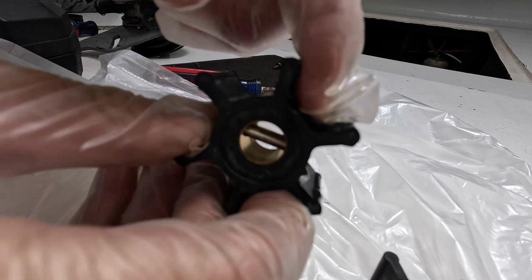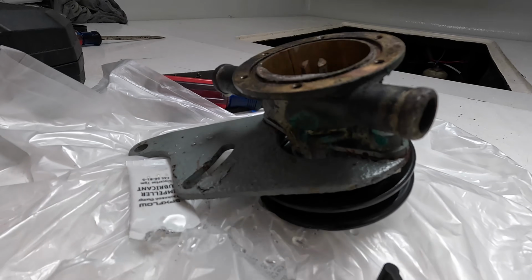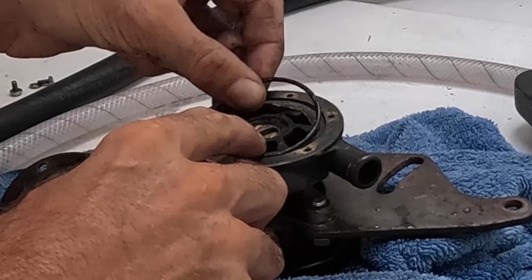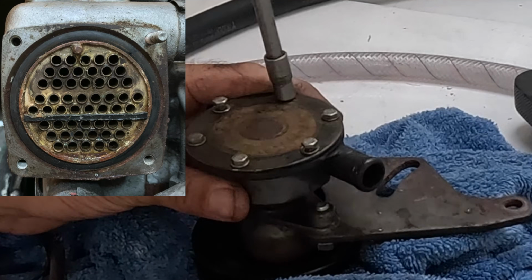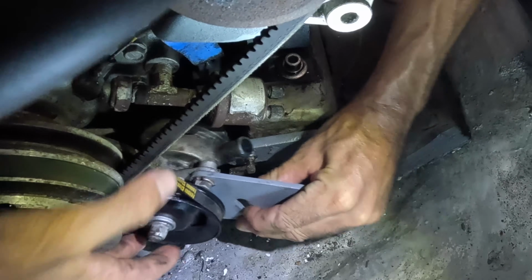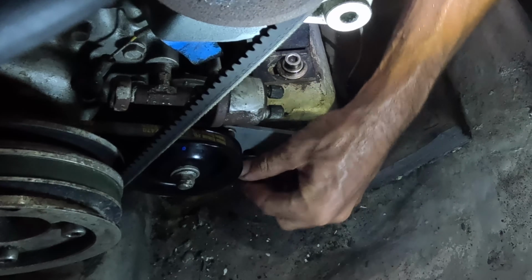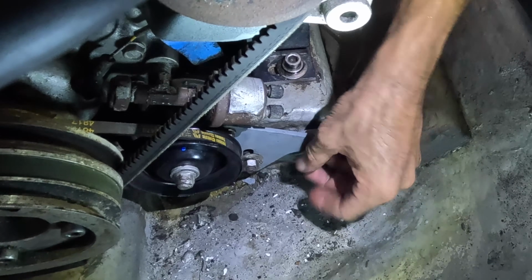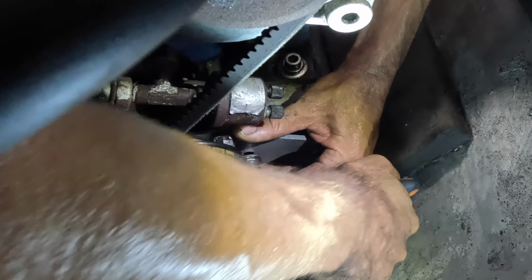So with a boat, salt water is being pushed through a heat exchanger and then is pushed out of the boat again. And in that heat exchanger are also, separately, a whole bunch of other pipes where antifreeze is being pushed through by a different pump. Because the salt water is pushed through that same box, the salt water is able to cool the antifreeze, but they don't get in touch with each other. So that's basically how it works. And yeah, let's replace it.